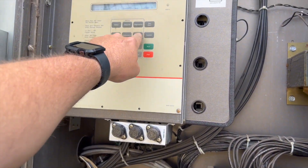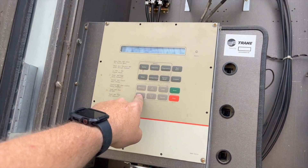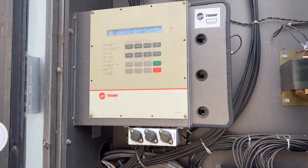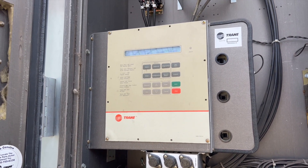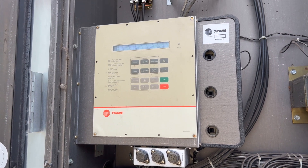We'll hit service mode so we can get ready, then keep hitting next until we get to our compressor circuits. We're going to wait until our blower motor ramps up all the way. I've already checked the filters — filters are clean, we actually just replaced them recently.